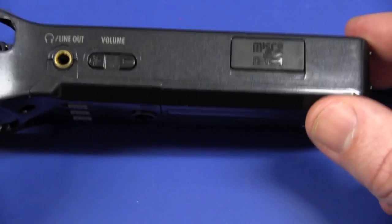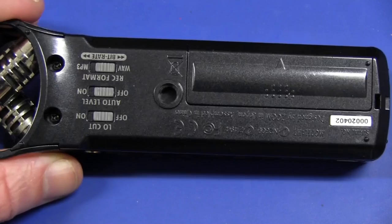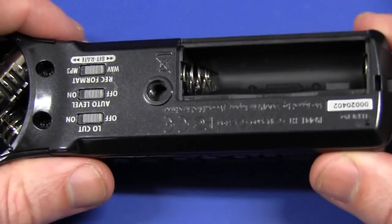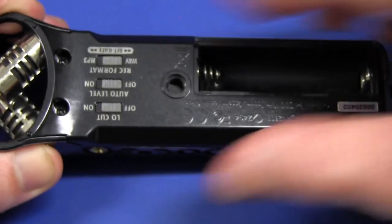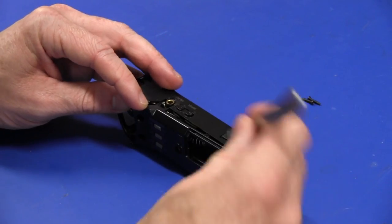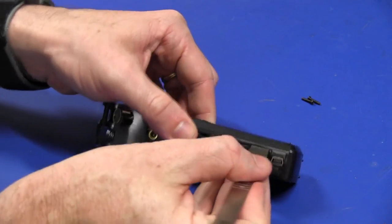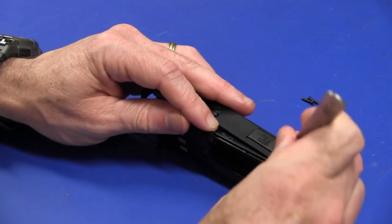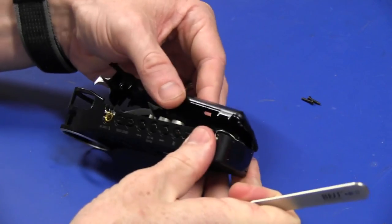The micro probably controls the SD card and writes directly to it. Let's open it. Looks like we've got two screws, and let's see if there's another screw inside the battery compartment - doesn't look like it. So I'll take out these two screws and maybe it just lifts off. Using my spudger here... there we go. It's got a clip there and a clip there, and probably another one up the back. Bingo - there it is!